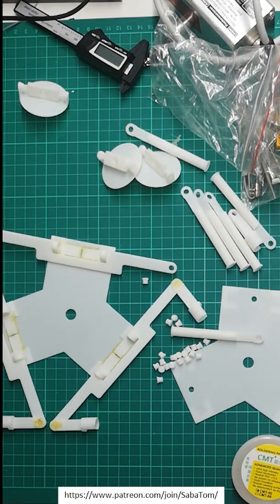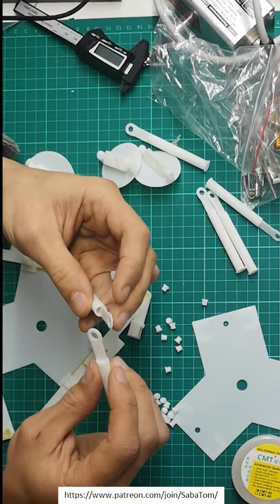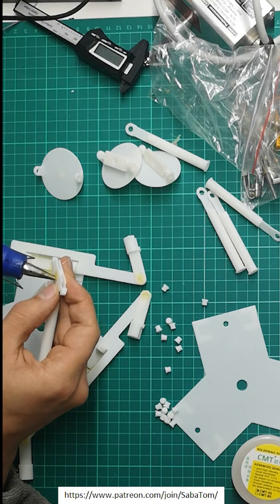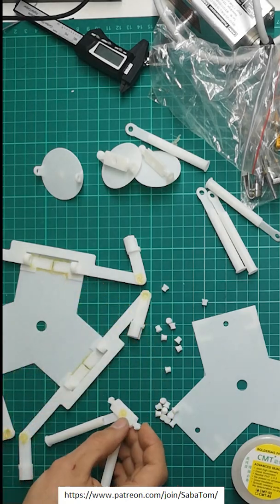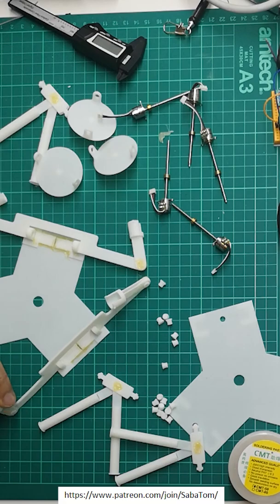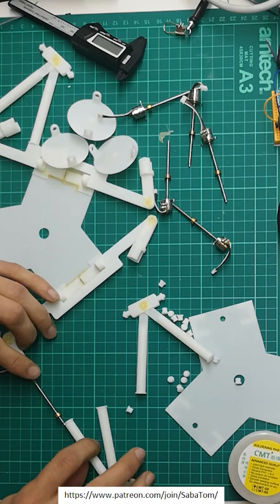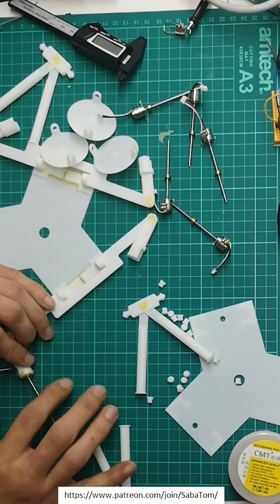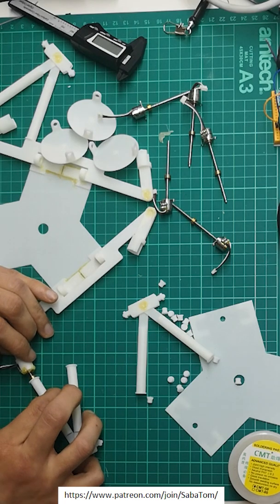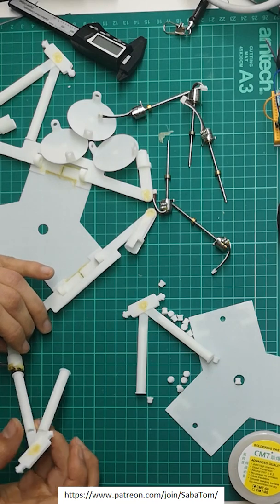When I was filming this I didn't look at the camera — an amateur mistake. You can see two pieces come together and get inserted into a hinge, again hot glued in place. I decided to show the whole assembly process in case someone wishes to attempt building one. You can also modify the drawings — I would suggest making your own. For example, where the lead screw connects, the cavity in the leg is big enough for the screw to go all the way in, but the shaft is very thin, and it would make sense to use the length of the leg to stabilize the shaft instead.